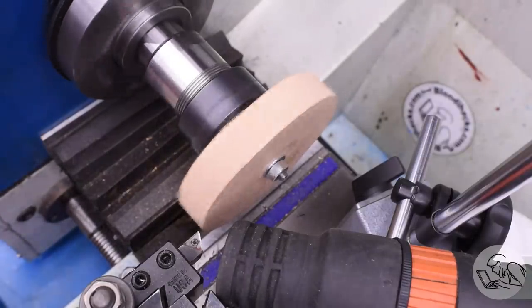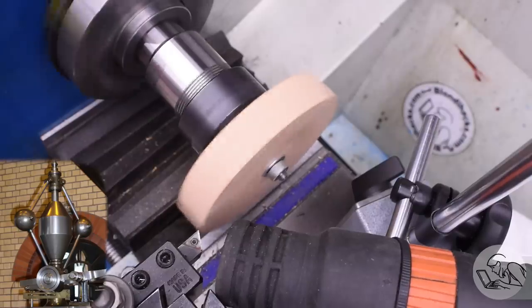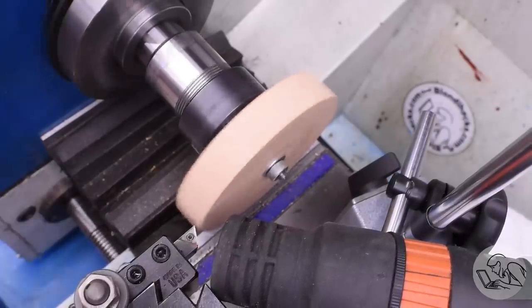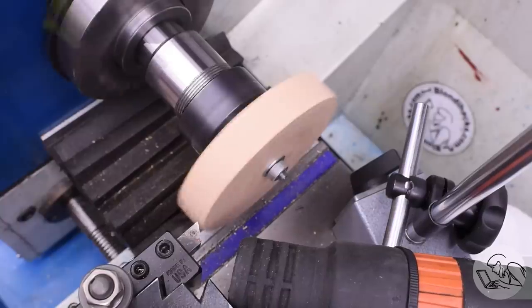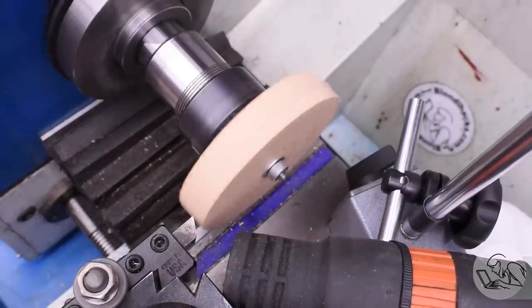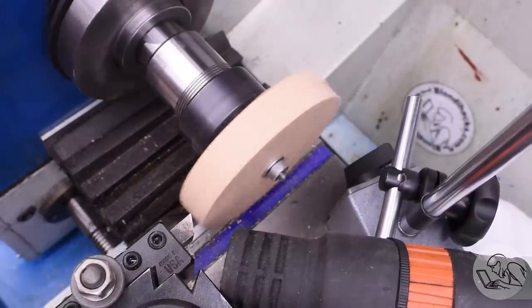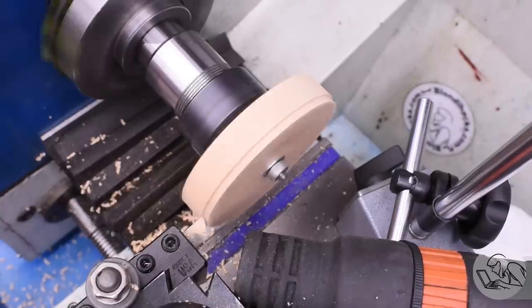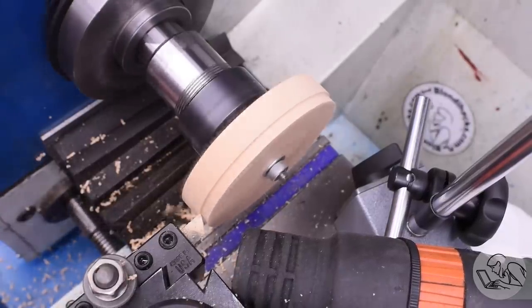For RPM, I chose balls out on the rationale that woodworking tools all run insanely fast, so wood seems to like speed, and I chose a very sharp high rake insert, also on the rationale that that seems to be what woodworking tools all have on them. You can see I've also got a shop vac set up close to the tool there. I'm trying to minimize the amount of sawdust and wood chips that get on the machine.